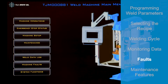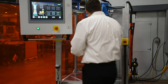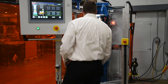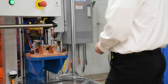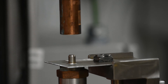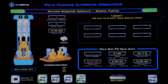Faults are indicated with the stack light, tooling light, or via the HMI. Here are a couple of examples. If the wrong part is scanned, the tooling light will flash red. If the part is loaded in the wrong fixture, the light will flash red and a beep will sound from the stack light. Process faults will give you a visual indication of where the fault is on the HMI. Here's an example of a nut loaded upside down giving a stack-up fault. The operator will have to acknowledge this type of fault from the HMI.